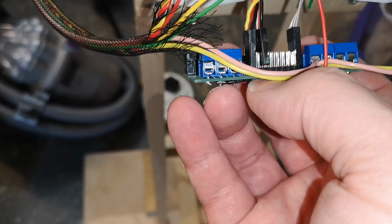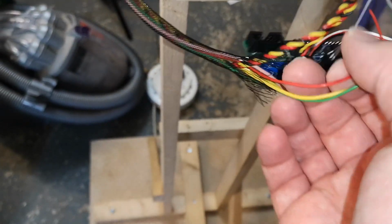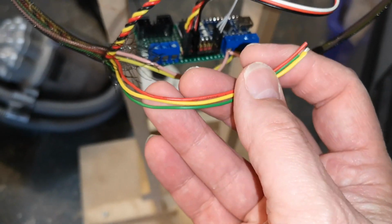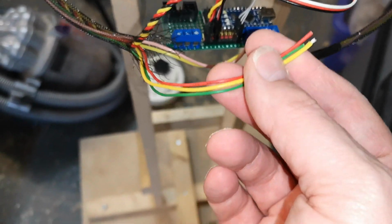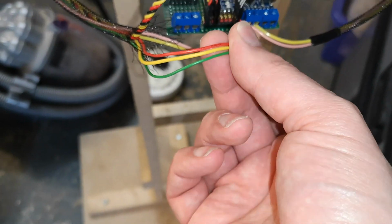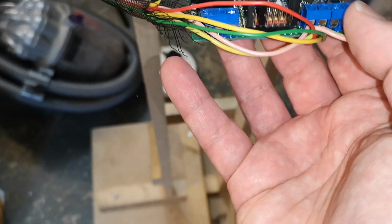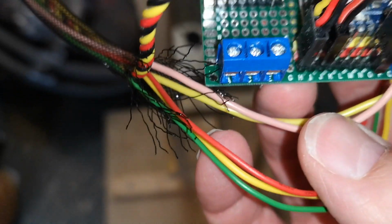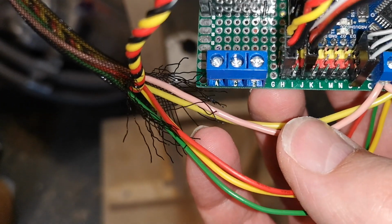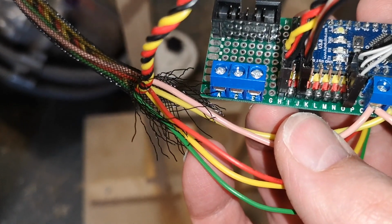so I can plug my header, that plug that I've built up, onto one of them, and then we'll have to terminate these cables here, which are the potentiometer connections down in the servo. I have to terminate them with a plug and put them on the next connection just next to it. So I think they'll be on J and K, which are just jumpered together.